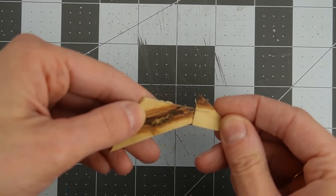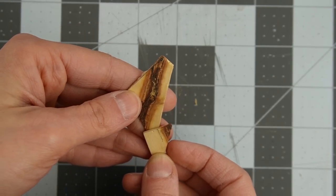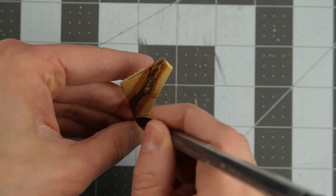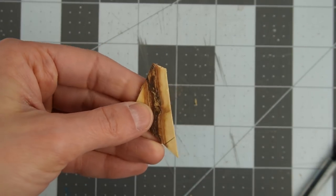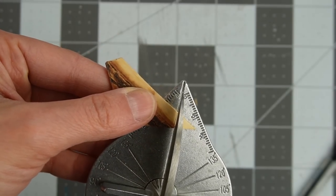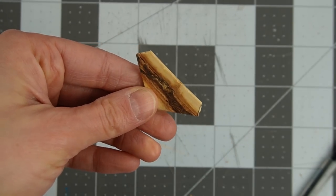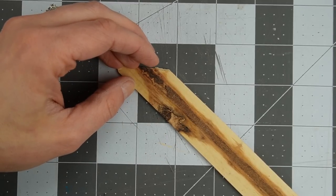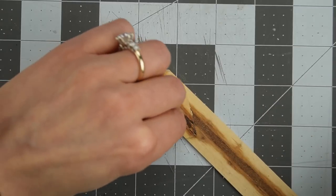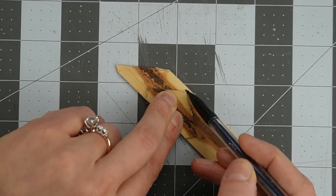I'm angling the front of the shelves to add support pieces. To avoid doing math, I traced the size of the angled cut I just made onto a scrap piece of wood and traced it onto the other side. I would normally line the shelf up with the cut end I made, but I really want this knot on one of my shelves, so I'm centering my shelf over my favorite knot.